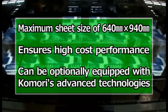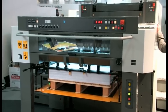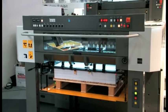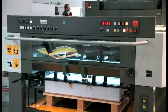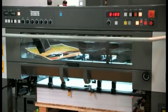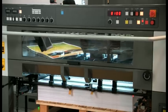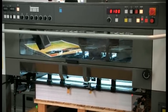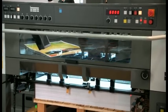We believe that printers around the world will be able to make the most of the benefits of the LA37. We're gearing up now to start our second job, which is the fashion magazine. The Lithrone A37 requires no gripper pad height adjustment, and the sheet thickness range is 0.04 to 0.6 millimetres. Any other adjustments necessary are very simple and easy to do from the console.